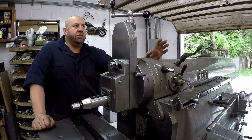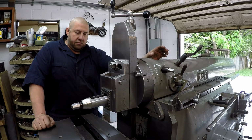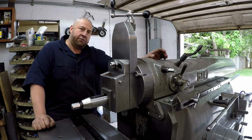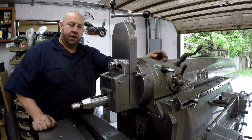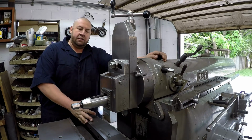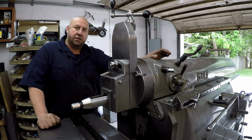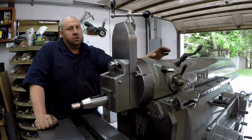So what I want to do now is go ahead and get some material and get our tools set back up and try some more cutting. I want to try a couple things. I'm going to try another heavy cut. I'm going to make a modification on my tool grind. And I also want to make a vertical cut using the auto down feed. What we'll probably do is mount a piece of stock in the vise and come over onto the side and make a vertical side cut on that, okay? That'd be a good use for something like this. So let's get going.